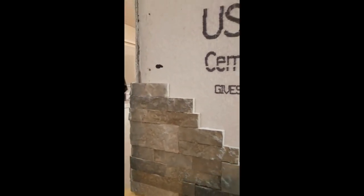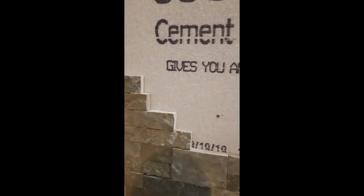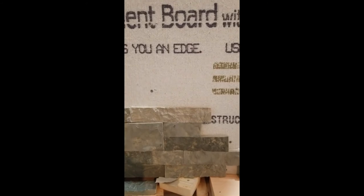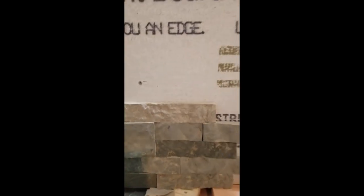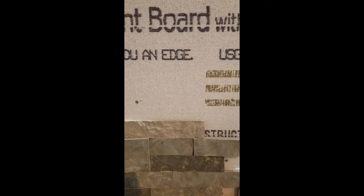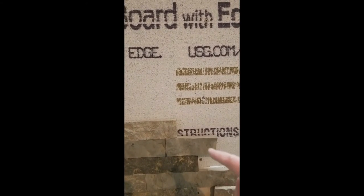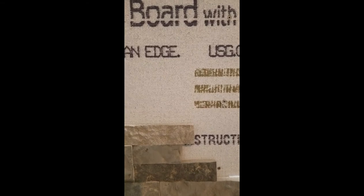Here's a little tip. I'm working on this end of the bar and I've got it stepped like stairs, which makes it easier because you don't have to fill things in. But for this section, you can see there's a little bit of a gap. My advice is put a spacer in there, because what will happen if you don't — and I found this out the hard way — is that you'll have to grind down the ends to get it to fit. You don't want to leave your work area with those types of openings. Using a spacer lets you pop that piece back out and have the correct space. It'll save you a lot of grinding time and shaving down those edges.